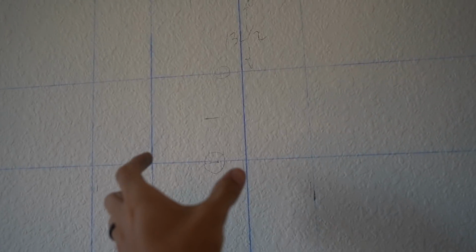All right, quick change of plans here, guys. We have our 1x6 in the middle. We're also gonna have a 1x4 on each side of that. That's the update that we made. So now that we have that, now we're gonna get some samples of our shiplap. We're gonna make that 1x4 shiplap on the table saw and the router, and then we'll come in and figure out the pattern.